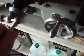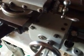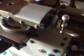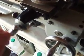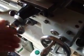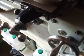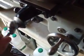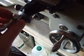It looks quite good. So I've got it together now. It seems to be running quite smoothly. A little bit stiff, maybe. I've got the gib screws tightened up, maybe just a little bit too much. But no, I'd say there's good feel there. You don't want it too slack, because then you'll get no feel from it. On testing it, just at the moment without the lathe running, the action seems to be quite smooth and steady. There is a little bit of backlash in it, not a lot. I've fitted the proper fibre washers inside it. So yeah, I'm quite happy with that. That's about the backlash there. Not a whole lot. It's quite satisfactory.